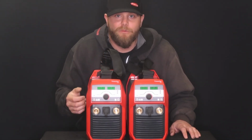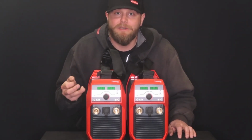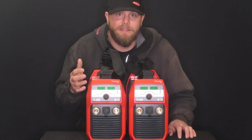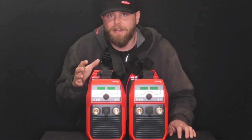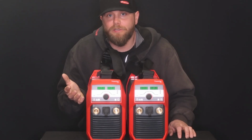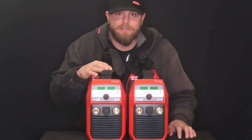So DC, what kind of applications can you do? You can pretty much do about 90% of your applications. So it could be chrome moly, titanium, carbon steel. The only thing you can't do at DC is you can't weld aluminum or magnesium. So something to think about is, are you really going to need a machine to weld aluminum? If not, this one will cover about 90% of the applications.